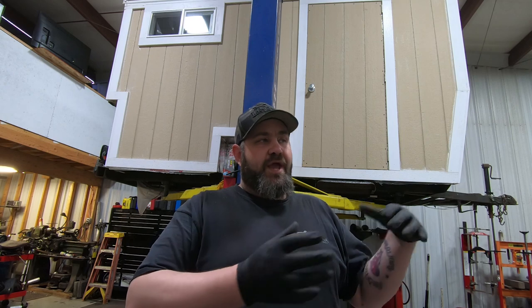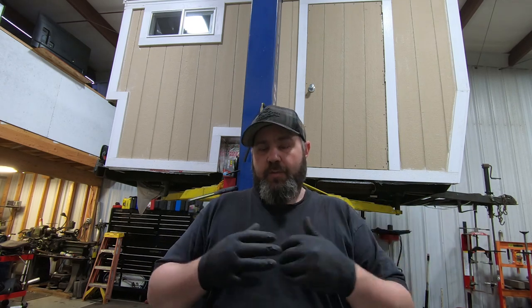When I went there, we weighed out the steel, and we're going to be putting about an extra 40 pounds into this thing with just those two braces. So if you can imagine, if only two pieces of steel are 40 pounds, you're talking possibly adding 150, 200, 300 pounds by the time you get done gusseting everything. And we can't do that. We don't have that option. We don't have that budget. So we're going to have to be very careful with it.